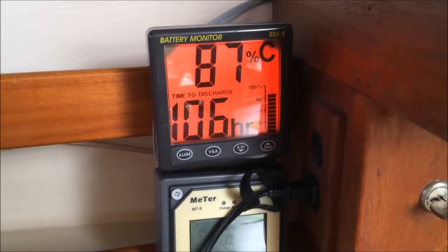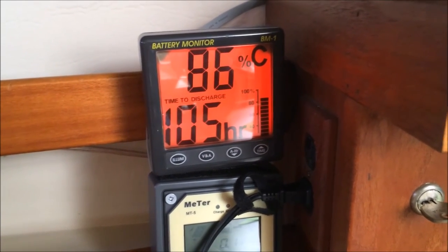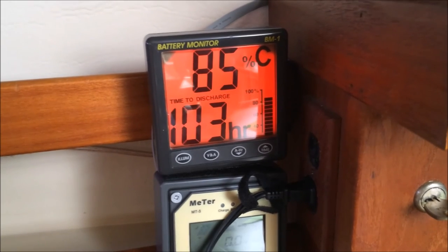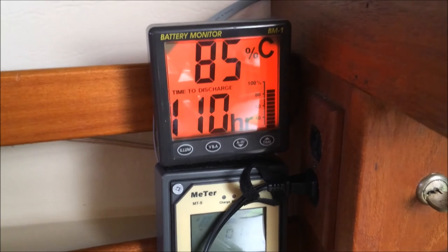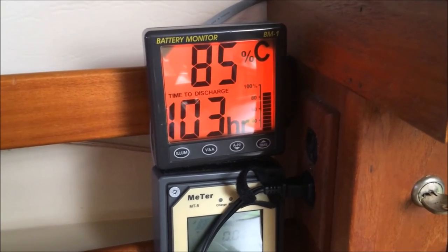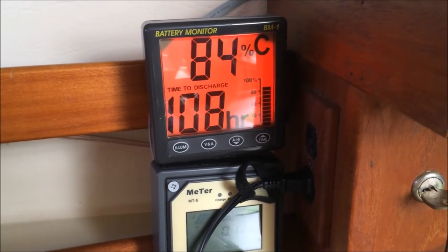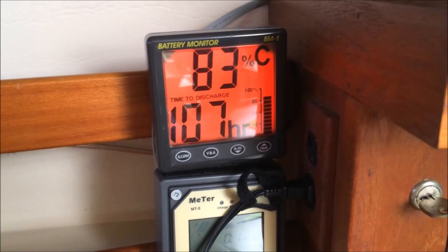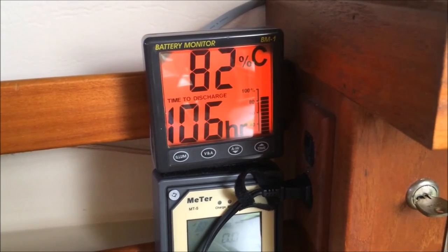In conclusion, it's a pretty good battery monitor. I'm not sure if other ones will do a better job reading the higher charge level of the battery. As you can see in the video it had gotten up to 100%, but with the same load from the beginning of the video you can watch it drop fairly quickly down to 80-75%, and then sort of stick there before dropping at a much more reasonable rate based on its calculations. I've been unable to determine exactly why it does that — it did the same thing with my old batteries and never really read more than 80%. From what I've read online, there are some calculations this tries to do automatically that higher-end battery monitors let you program in manually, which could account for the discrepancy.